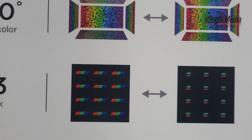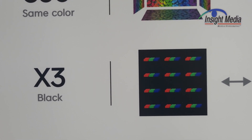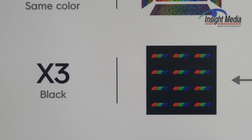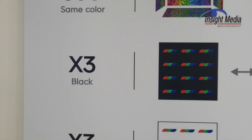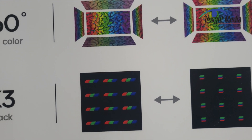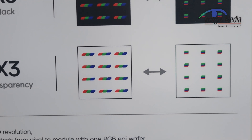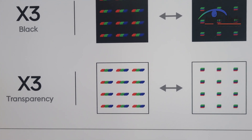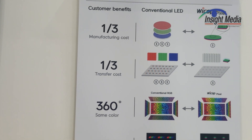In addition, having them side-by-side can actually cause a color shift as you go from one side to another. So for the red LEDs, you might have a red hue when looking from the left side, and from the right side it might have a little bit of a blue hue. You eliminate that theoretically if you stack them vertically. It also has an advantage in transparency, because you've got much more open area — less space taken up by the LEDs themselves.